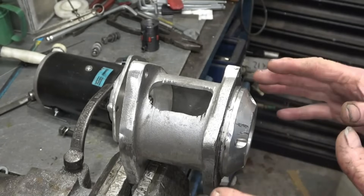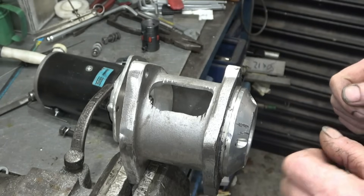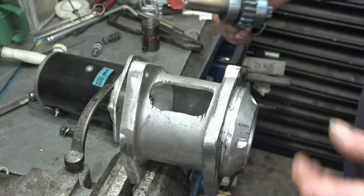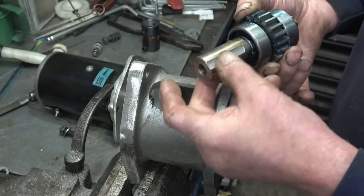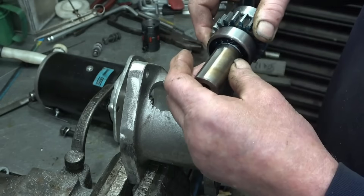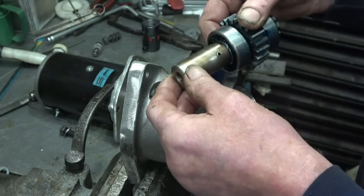Unfortunately I've lost some machining video — I've had a memory card crash. So all I can do now is show you what I've machined and basically put this drive back together. This was going to be the problem part, and I've actually machined a steel sleeve — as you can see it's a shrink fit on that shaft, really tight. And then I put a roll pin through for good measure, and it runs nice and true. So that's going to be fine for that part.